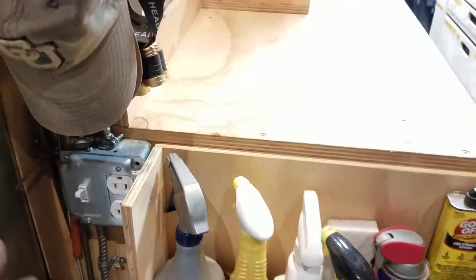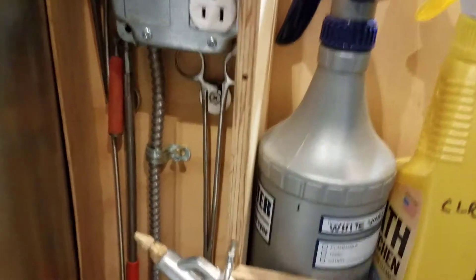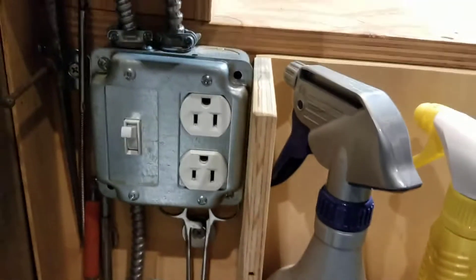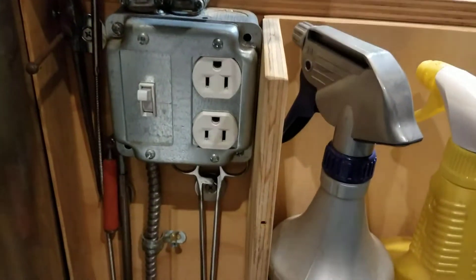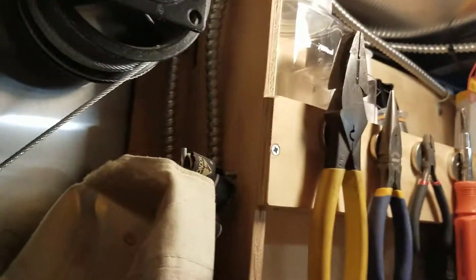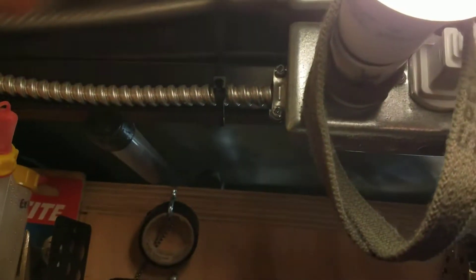But then the next step — that light switch, which is wired. The upcoming feed is going to go down through that cubby right in there, and then it goes back to the actual electrical feed. So it feeds from up, feeds into this. That outlet is always hot, and then we have two lines coming out of there. Those lines come up through the hatch, rejoin up there, come over, and you can see one that tails off to the right here into this switched outlet, and that's what that switch controls.